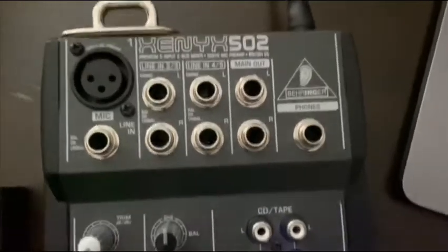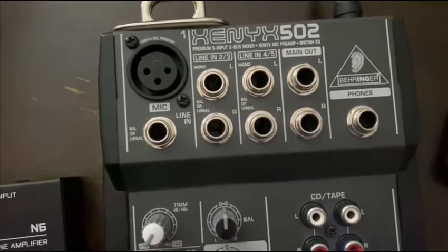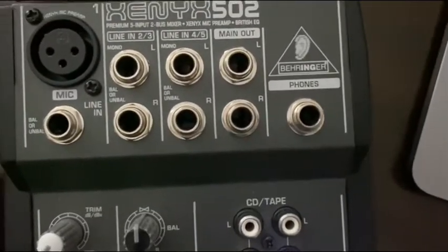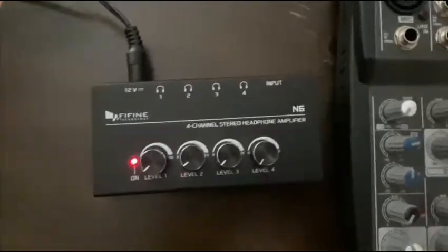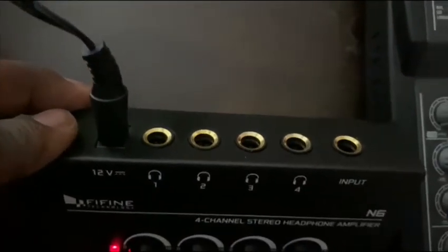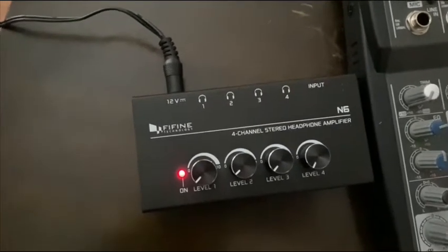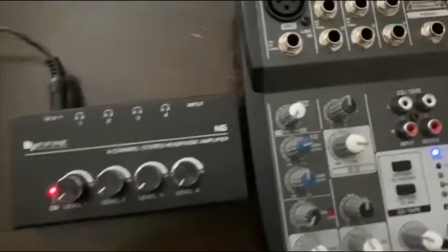There's channel one, line in two and three, and line in four and five — that's where you can plug things in. For example, I might put tracks left and right into line in two and three — split my click and guide and tracks that way — and then into lines four and five I might run in some keys or whatever. To the right you've got main output left and right, which sends all the audio from those channels out wherever. We won't really be using the onboard headphone output — instead we'll be plugging into the headphone amp, which has an input and four headphone outputs.